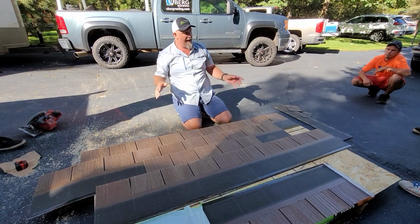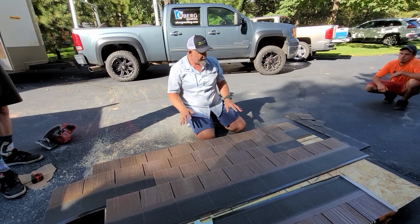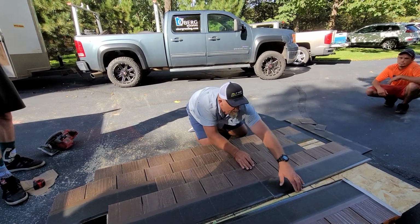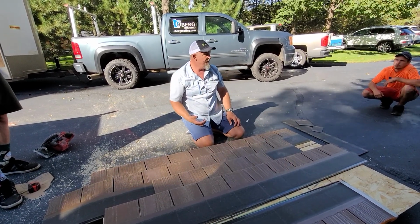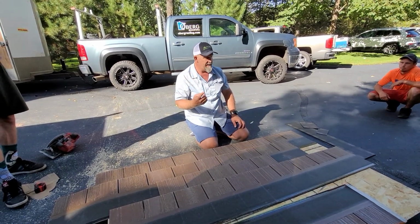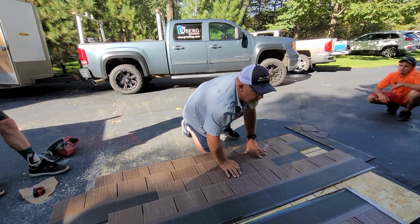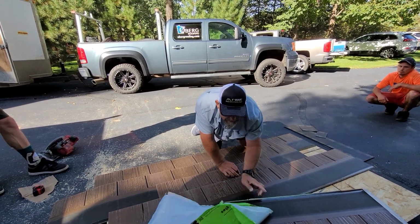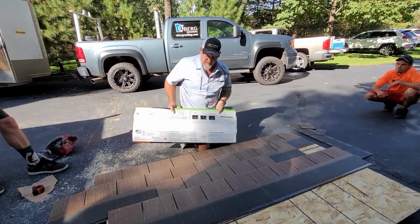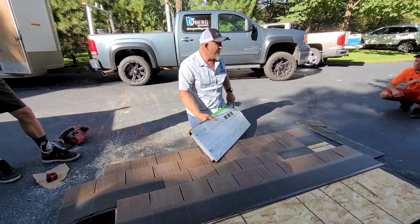These shingles are made with virgin material, so they've never had a life. They're born flat. They want to stay flat. If there's any reason for one of these tabs to sit upward, that means there's something underneath it. Debris. You're not using plastic caps, so that's not an issue. The decking could be uneven. But the biggest reason why the tab doesn't stay flat is a nail head. Again, the compressor wasn't turned up high enough. You can see right here, there's your right nail, there's your wrong nail. That will create a point load.